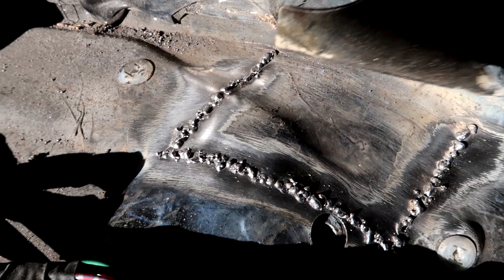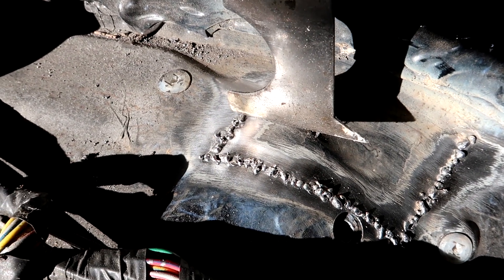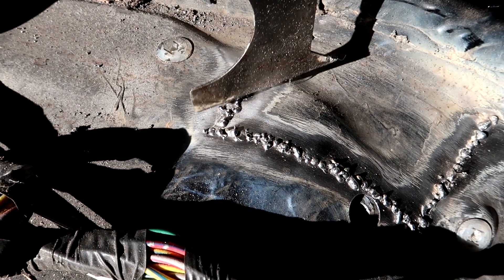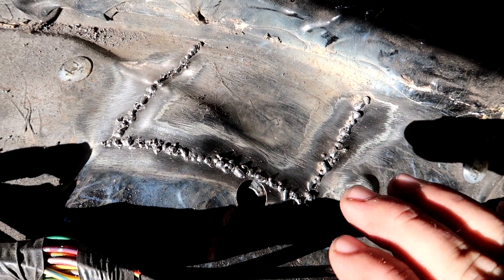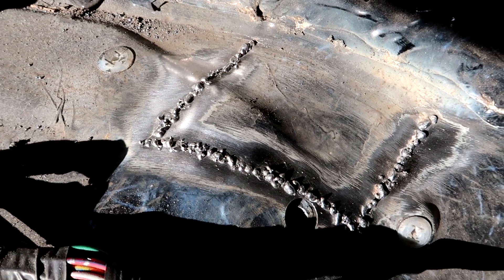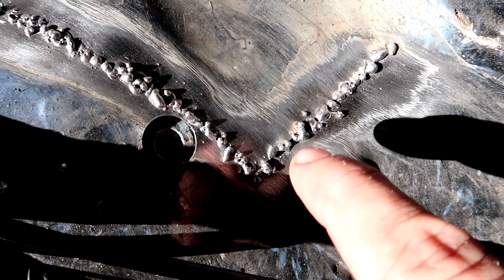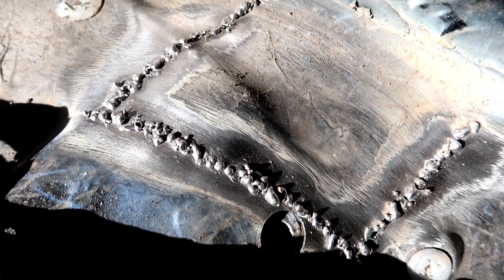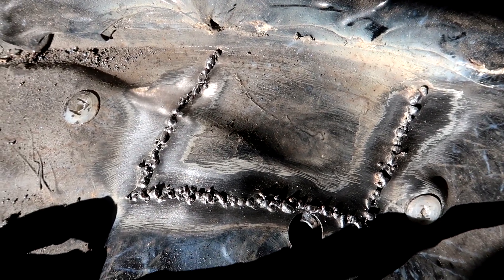That's about a million little spot welds, but I'm keeping it nice and flush. I was using a putty knife to hold it down flush and get spot welds — did that all the way around. So once I grind this it should be all nice and flush and smooth. I think I'm gonna break out the grinder. I still got a couple little holes here so it's not gonna be perfect after I grind it, but it'll give us a better idea where we're at.